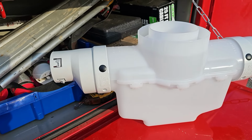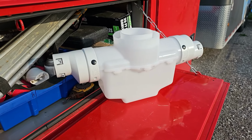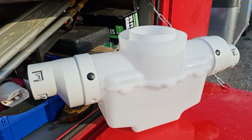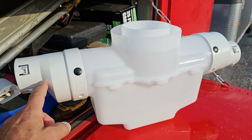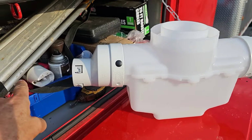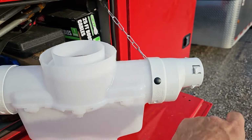All right. So now this one's a little advanced. This one's for the drainage contractors. They already know what I'm going to say. So if you have a really filthy line and you don't want to clog your pipe, you know there's a lot of garbage coming through this line. Instead of going in shallow and out deep, now the water's got to climb and come out higher.